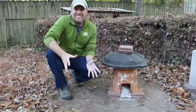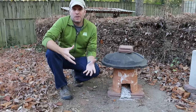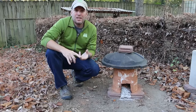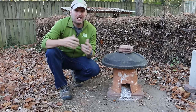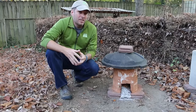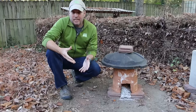When you're working with clay and sand, cracks are going to be inevitable. It's part of the drying process. As the stove shrinks down with a combination of heat and as the air dries it and pulls the moisture out, it's going to shrink. And if that shrinking happens at all unevenly, that's how we're going to get cracks.